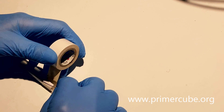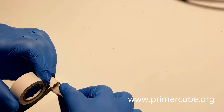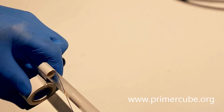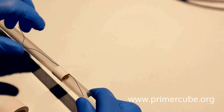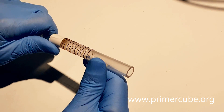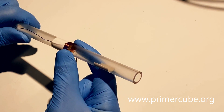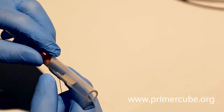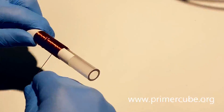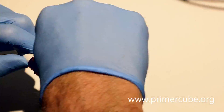For these tests, I made coils with 400 turns each. You could increase the number of turns in these coils and thereby increase the voltage produced when the magnets shoot through them. But the higher the number of turns in the coils, the more they will slow down the magnets shooting through them. Therefore, the optimal number of turns needs to be arrived at by continued testing. If you try to capture too much energy with each coil, the magnets may slow down so much that they will not make it through the next magnetic array — in other words, they will stop.